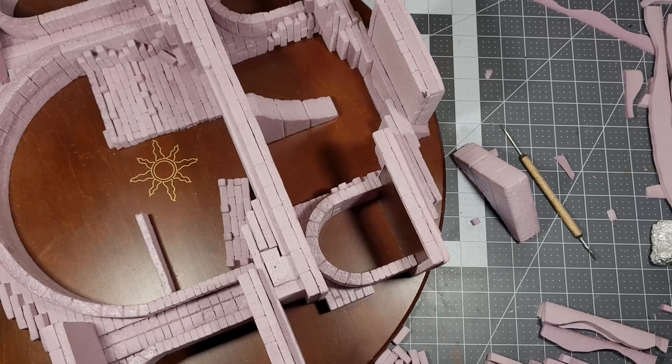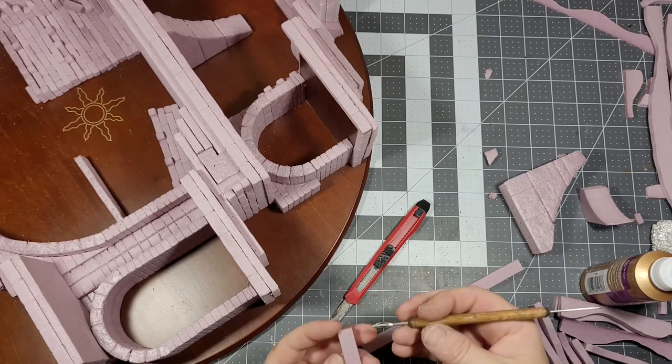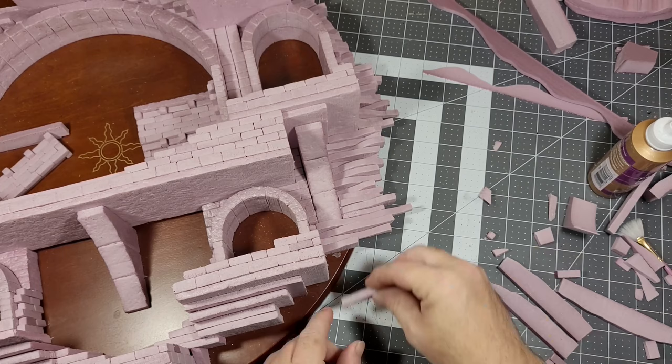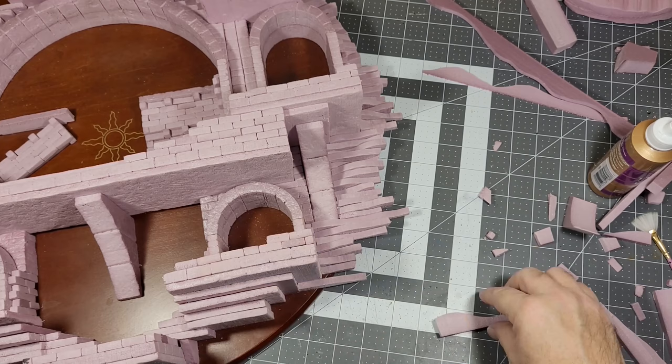All right, I'm just going to finish up a little bit of brickwork here before I can lay down the back. As I'm starting the back, I'm making sure that I'm just using random pieces, just that they don't match up. I'm not going in any particular pattern with this. I'm taking the time and cutting little shims on the smaller areas to kind of even it out. That's just basically taking to the bandsaw and just ripping down the piece just a little bit real quick.